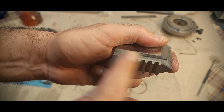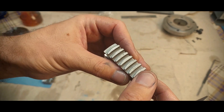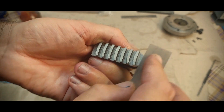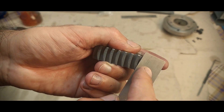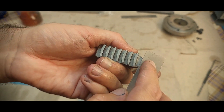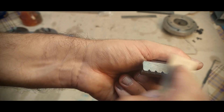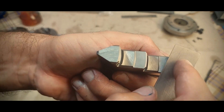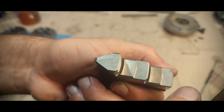Deburring may sound like a quick task, but if you go through the effort of making every edge smooth, it really takes some hours. But it pays off. Having a machine that is smooth to the touch is something that must be experienced. Here I'm using a 600 grit diamond coated strip. It just barely cuts, but it's enough to knock off those sharp edges. I'm doing this to make sure all parts register correctly against the machine faces and not against some burrs.